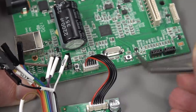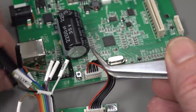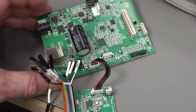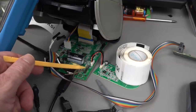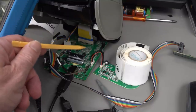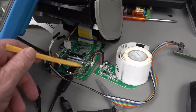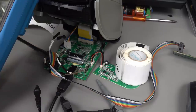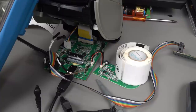I've added two little SMD switches and found a serial line — transmit, receive, and ground — and I'm tapping off a 3.3V line to see if I can get any boot-up code. The bad news is I can't get anything out of this serial port at all. The boot button does absolutely nothing; the reset button does actually work. No combination of boot buttons with the front panel buttons does anything at all — not a single transition out of the serial port. This almost certainly indicates the STM32 micro has been put into protected mode, which disables all the debug interfaces and prevents you from reading the code back out.